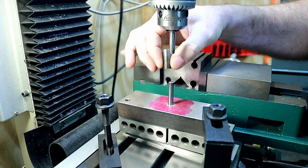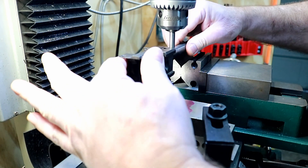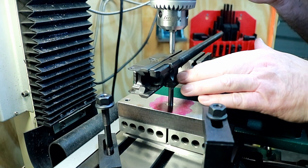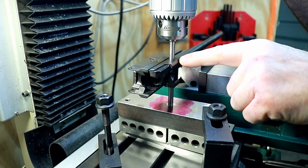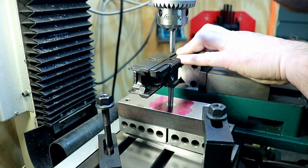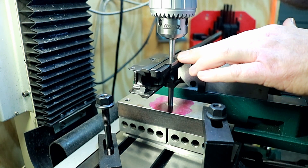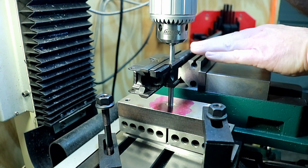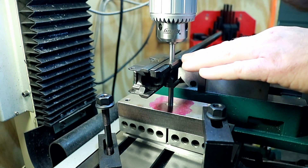Now I know that this is aligned. Since I have the DRO, I'd zero it out right there. This would be riveted into a trunnion, pressed in, so it wouldn't flop all over the place. We know we're good here. This is the point now where you can bring this down. If I know I'm good right there, I could snug everything down. If you leave it loose here, you can slightly shim it or whatever you want to do, then snug it down. You just have to play around with it until you get it where you're happy.